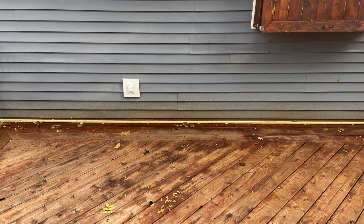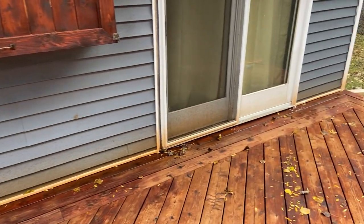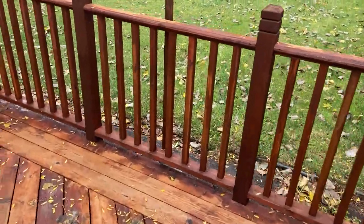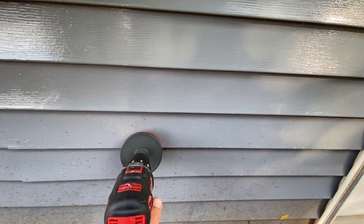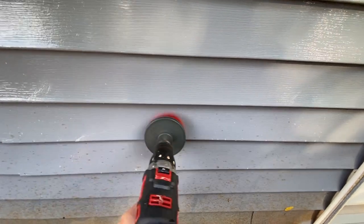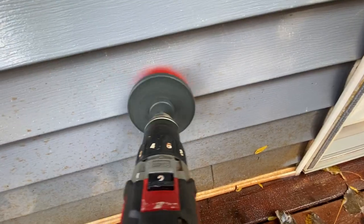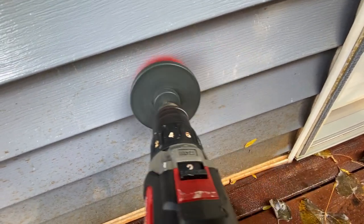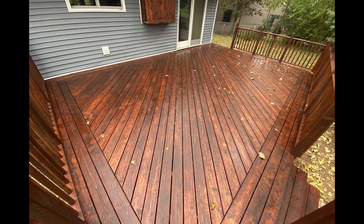The big lesson we learned here was that after the deck had been stained, we had a surprise storm and rain came about an hour after we finished staining — the oil didn't have enough time to absorb into the wood. The previous coat had hindered the wood from absorbing the stain as quickly as we thought. To fix this, we came back and scrubbed the deck with soap and degreaser using a power scrub and had to refinish the deck. This time we made sure the deck had two or three days to dry out.